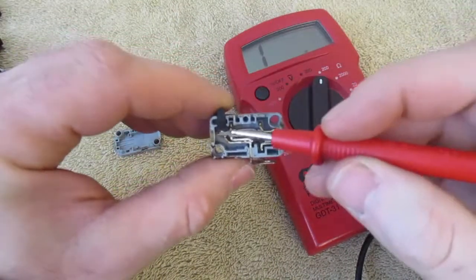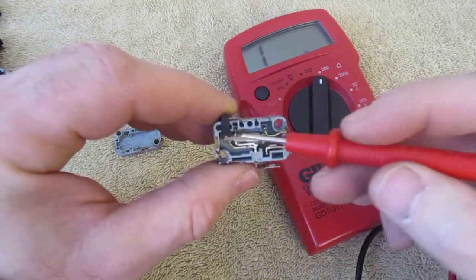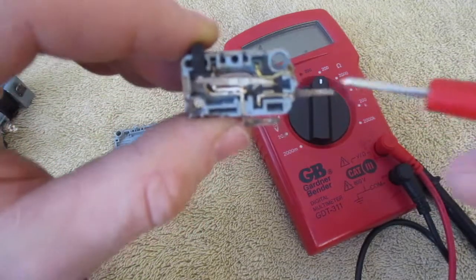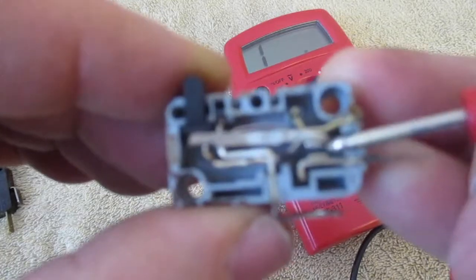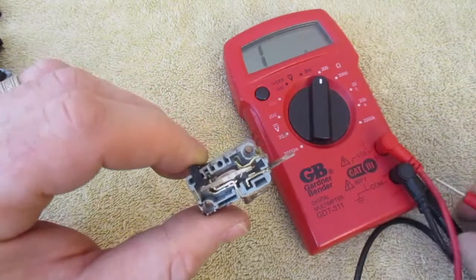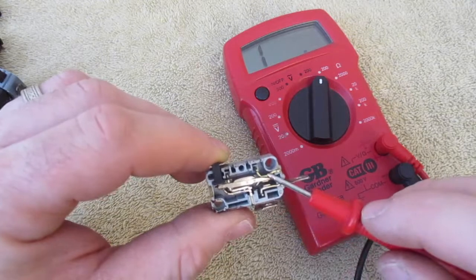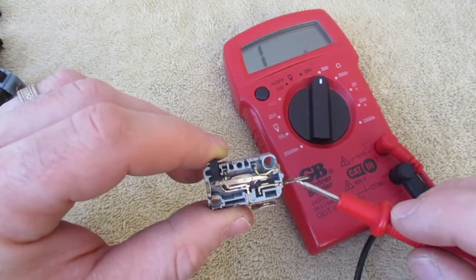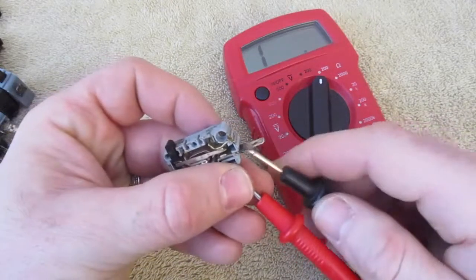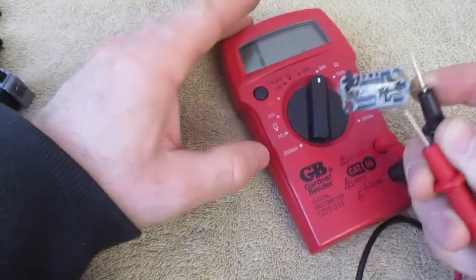As you look here, you can see here's one of the leads. Power is going to come up through here, and you can see there's a little space right here at the tip. Because there's a space there, when electricity is coming through here we cannot get power to hop to this other terminal. That's why when we put these two leads in there, we're not getting anything to come through — that's why we're getting no reading.